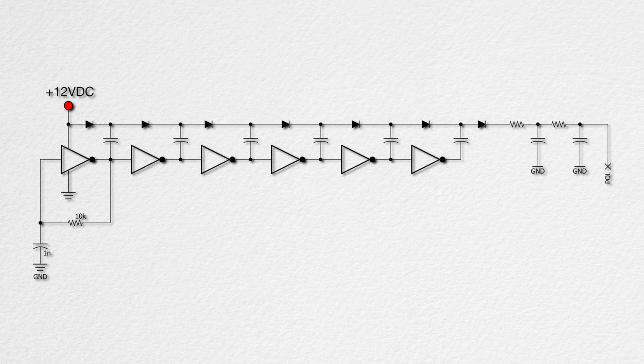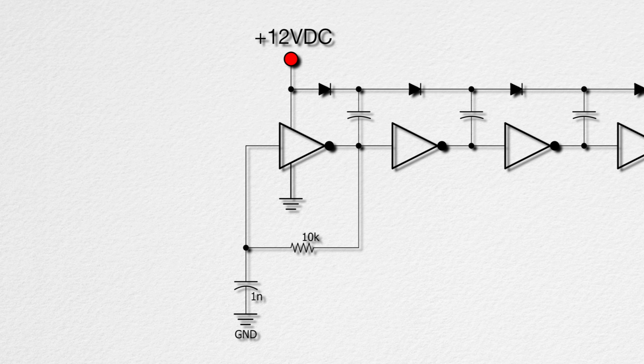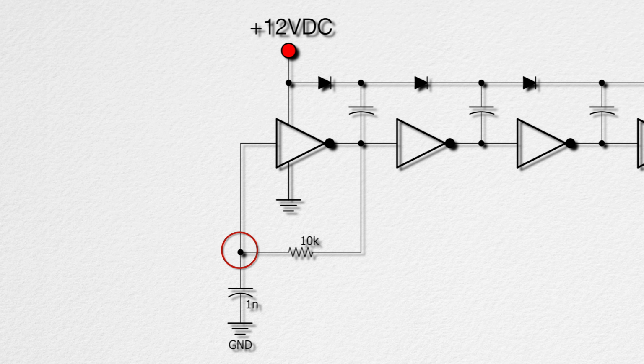To do that, we're using a hex inverter set up as a voltage multiplier. The first stage of our inverter is set up as an oscillator. When power is applied, in our case, 12 volts DC, the little 1 nanofarad capacitor is not charged, so there's 0 volts at the junction of the 10K resistor and the capacitor. That ground, or zero, goes into the input of the inverter, producing a 1 at the output, which is positive